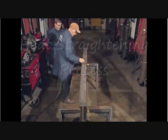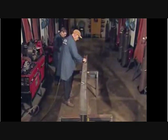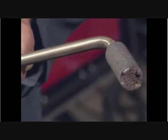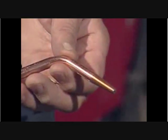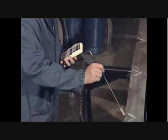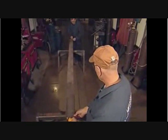To straighten a notable sweep on a steel beam, areas to be heated are marked with a V-shape along the flange edge. Using an oxy-fuel torch outfitted with either a rosebud or single orifice heating tip, the worker begins at the apex of the marked area, moving in a serpentine motion. A second worker does a heat check, which should be around 1,200°F. Within a relatively short time, a measurement shows that the beam has been straightened within the acceptable tolerance.